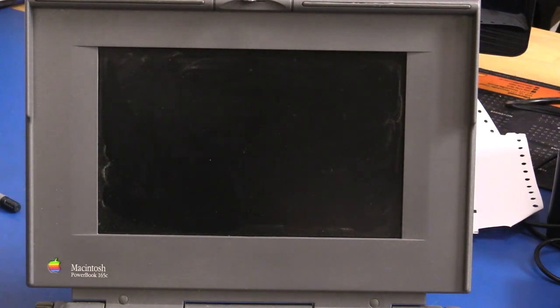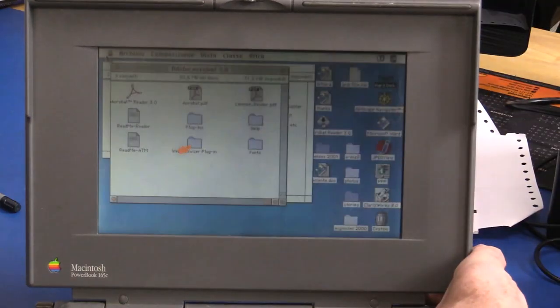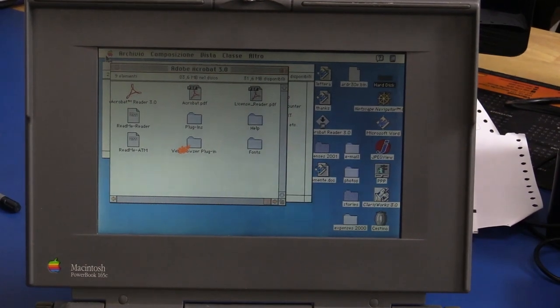Anyway, I don't know. It's doing something. Twiddle your thumbs. It's drawing 1.7 amps, by the way, at 7.5 volts, which is about 12 and a half watts. Aha, there was nothing wrong with that at all. It was just a matter of the brightness and contrast there. Check it out. We're in like Flynn. We've got a working Macintosh Powerbook 165C. What the hell can I do with it?